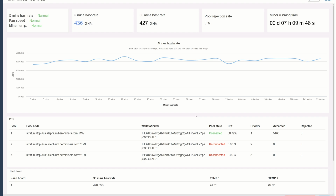So it's definitely looking like mining without any external fan is probably the best way to go about it. It does get the hash rate it's supposed to do. Adding a fan does reduce it slightly, but not as bad as it did with the Kaspa miners, the KS0 Ultras, KS0, and KS0 Pros. Now, obviously, if overclocking firmware does become available, you are going to want to get an external fan or something, bigger power supply, but right now it's really up in the air because that is a lot of extra cost as well.